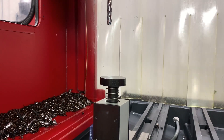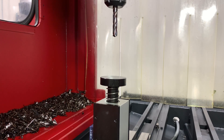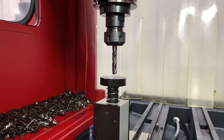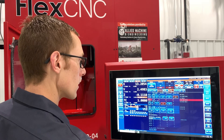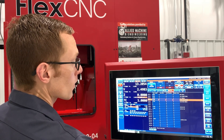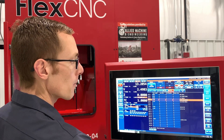All right, there's X, Y — and let's bring Z down a little closer. We're a little under an inch, so I'll go ahead and hit tool calibrate. It automatically comes down, sets the height. Going to our tool offset page — tool four — we set it there at 6.1508 for our 2764 Mega Muscle.